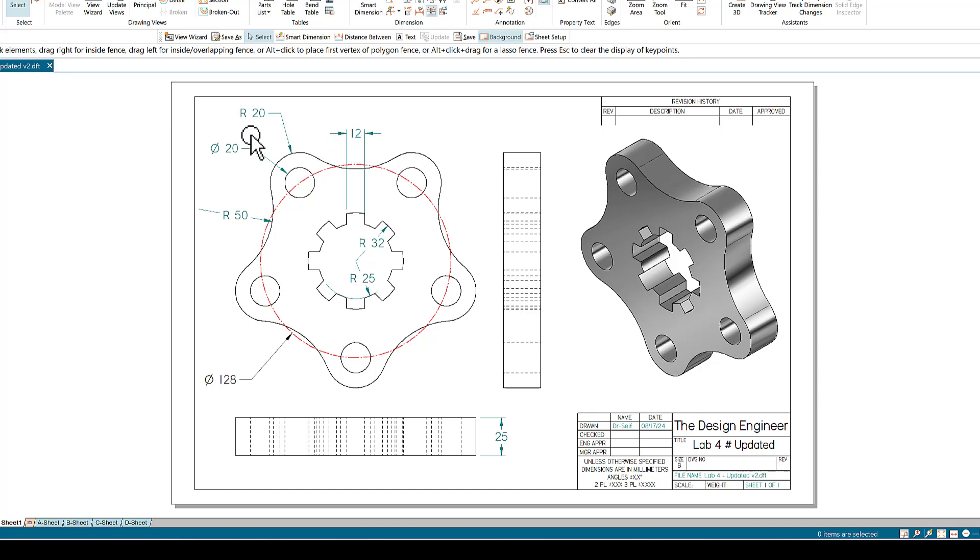In this lab, what we're going to do is draw this shape. To accomplish this shape, you can see it has a symmetric shape with five sides. I'm going to concentrate on the front plane projection, draw only one side, then use copy, rotate, and paste to accomplish this shape, and then do the extrusion.